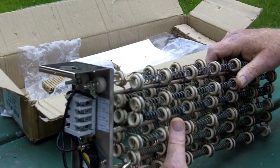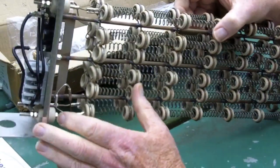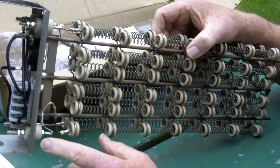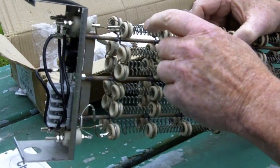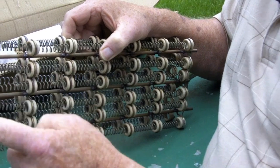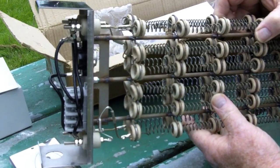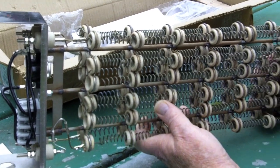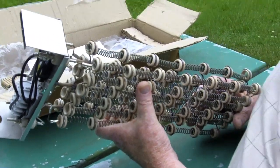The way the coil is designed, this coil has redundant safeties in it. You've got things called fusible links, and these are fail-safes. If this temperature limit switch at 200 degrees — which controls the air temperature inside the coil — ever exceeds this, or this switch fails, these burn through internally and shut the system down. There's no way that this system can get over 333 degrees. It will shut off, period. So it's a 100 percent safe system.